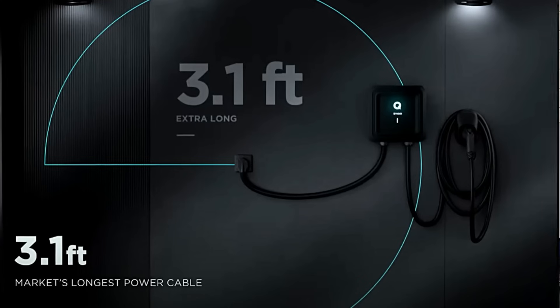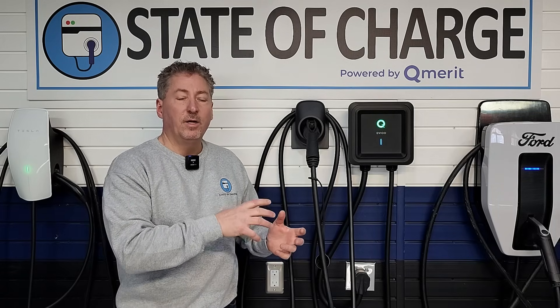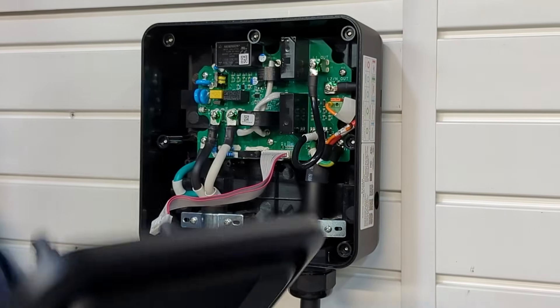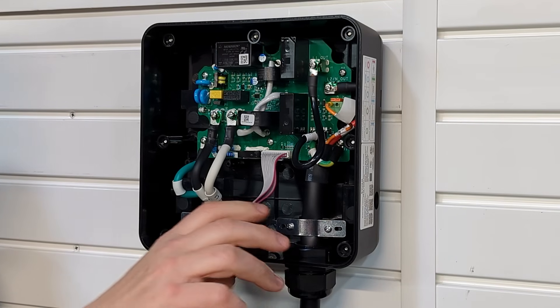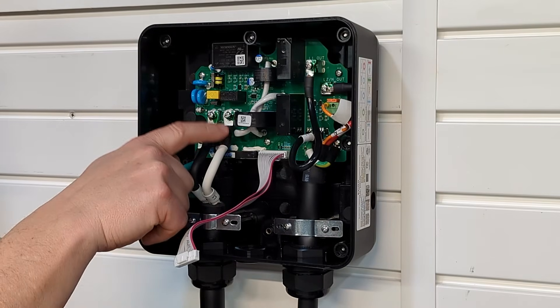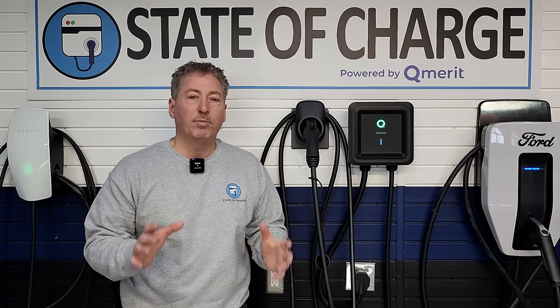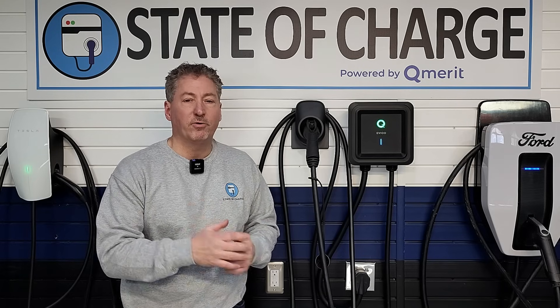It comes with a long cable — over 3 feet — to plug into the NEMA 14-50 outlet. Most chargers come with about a 12-inch cable, so this allows you to mount the unit without it needing to be right next to your outlet. Out of the box, the internal power output is set at 40 amps due to the NEMA 14-50 plug. However, this is a 48-amp charger, so you can hardwire it and then select 48-amp power delivery using a dip switch inside the unit. I encourage all followers to have a licensed electrician do that — they need to torque every connection correctly, and it gives you peace of mind.